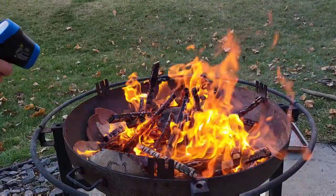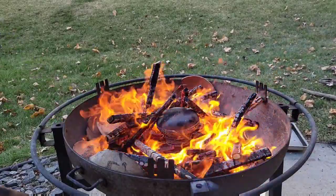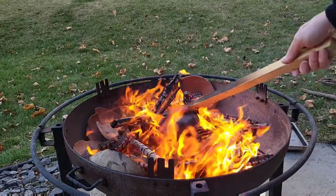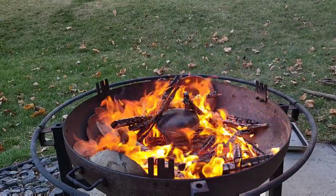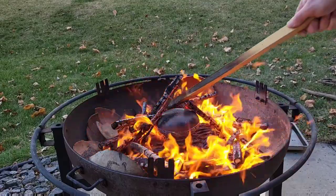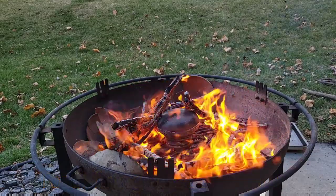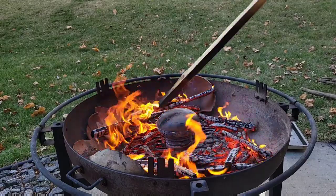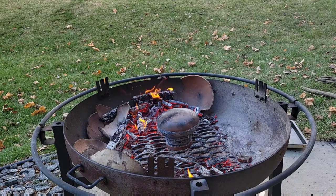That's 1250 on this side, 1400 on the other side — so it's hotter on one side. I'll be honest, I don't know if I've got this as hot as I should. I can see cracks on the top right here. We'll be able to test whether the organic paint did what it's supposed to do. I've been getting cracks on the top of my pots and I'm not sure why. We'll take a look once the pot has cooled off and see what we end up with.